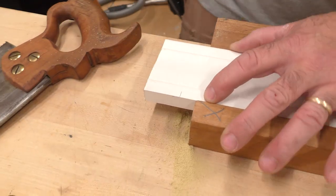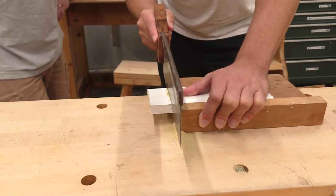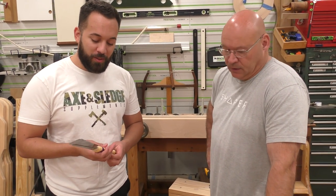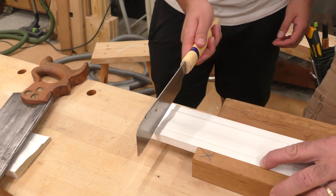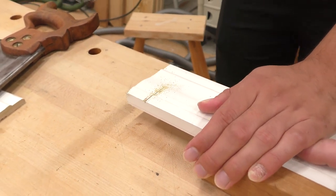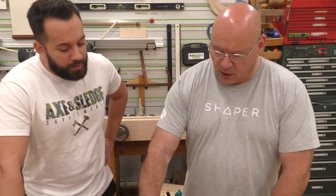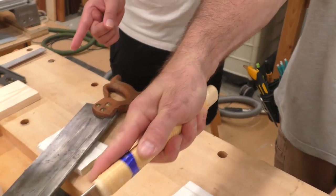You took that quick measurement — I'll get you in there. This one is Japanese, made in Japan. Go ahead and push it — just push it. It's not cutting, is it? Now pull it. Right — it cuts on the pull stroke. So a couple of things: set up your bench hook like this, same basic idea. And remember, that index finger is huge — it points and keeps you at 90 degrees.